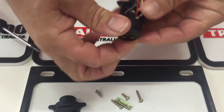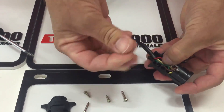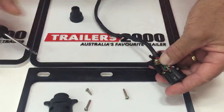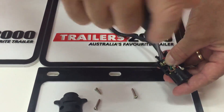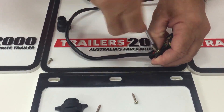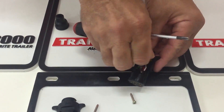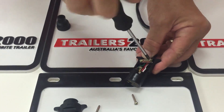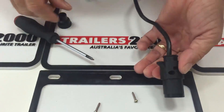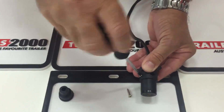We'll put the case back together — one side on first. This holder in the case has a little bracket to screw in rather than tying a knot in the wiring to stop it pulling out. We'll put both screws in there to secure the wiring so you can't pull it out of the plug and have to rewire it. Then put the other side of the cap back on with two more screws, and the end cap goes on — and that's the plug back together.